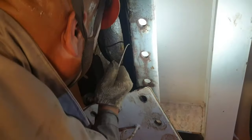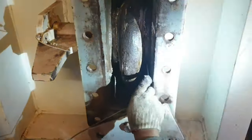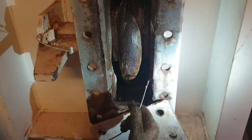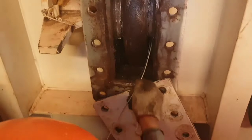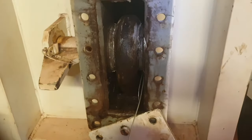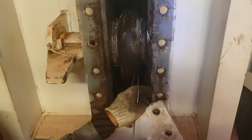In an emergency, you just want to let go of your anchor and chain by releasing it from the bitter end. Once you release the last link from the bitter end, you open your brakes and the anchor and remaining chain falls freely into the water. You will lose your anchor and the entire length of chain, but to avoid any disaster, this is the method which can be used.